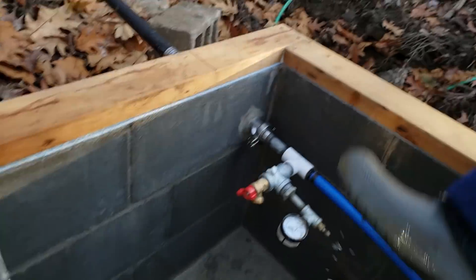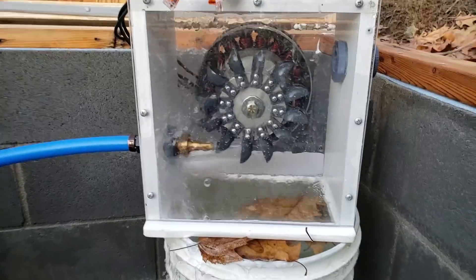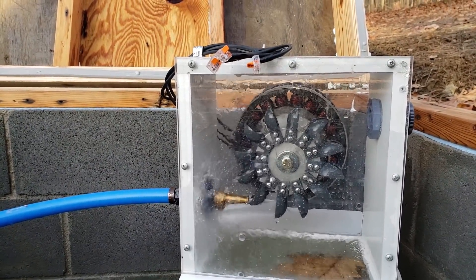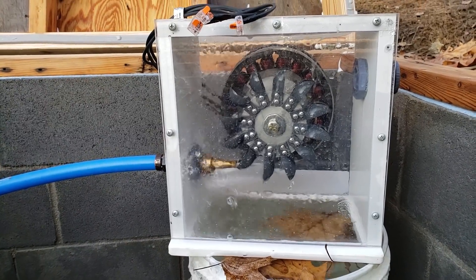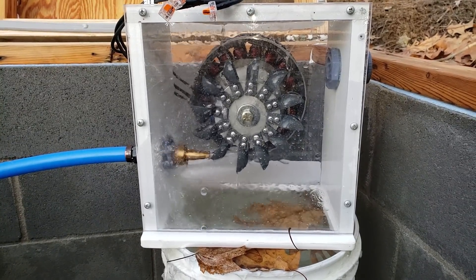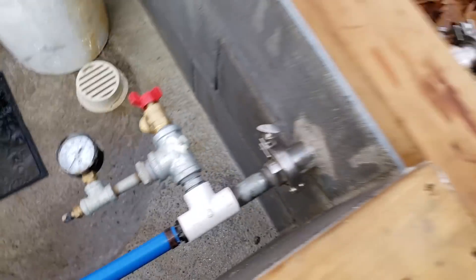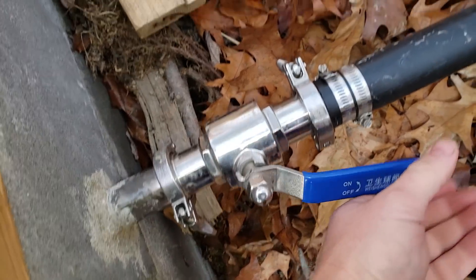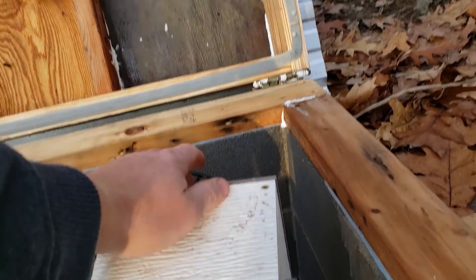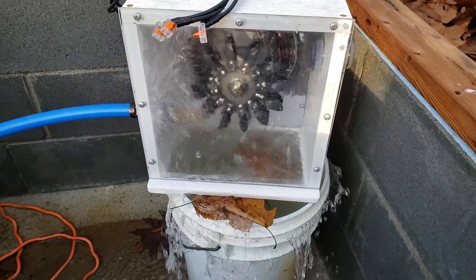I just don't have a whole lot of pressure to keep this running, nor do I have small, efficient jets to put on it. That jet is 0.181 inches in diameter, and it's probably flowing a lot more water than I even have available. Even with the valve fully open, it's still not spinning — even with a little kickstart it barely starts to go.